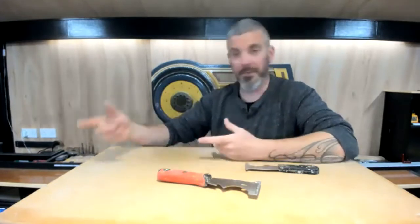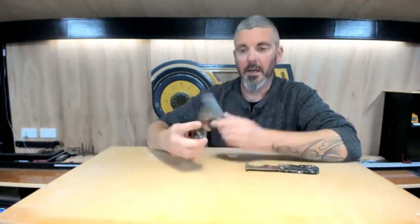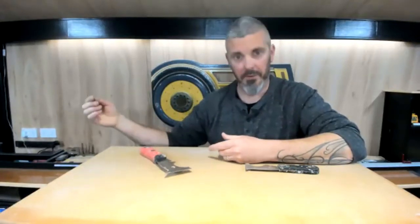Any holes you fill with polyfiller, like I said, the clay-based filler, and sand it down afterwards. I'll talk about sandpaper in a second. And I'd always rub over the wall with this, just knocking off any high points. You'll see the high points. This is brilliant for knocking them off, lovely sharp edge on it. And then you fill the holes. So the wall is done.